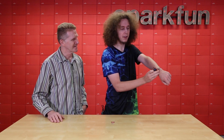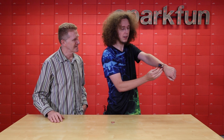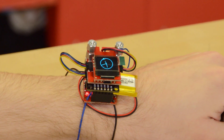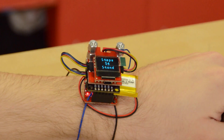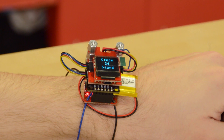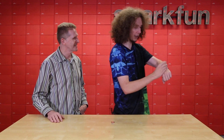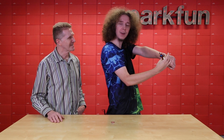On the top here I have the quick OLED that is being used to display the input, but it's obviously not a touch screen. However, if I tap on it, the screen actually does change. That is not touch detection — that is purely vibration measured by the BMA400. The SAMD21 processor I have on here is not actually measuring any of the acceleration; it is just using the interrupt feature. One of the other fun features of the BMA400 is the step counting. If I start running along, going all around the office, the step counting actually activates, and I can see so far I just took 21 steps right there.